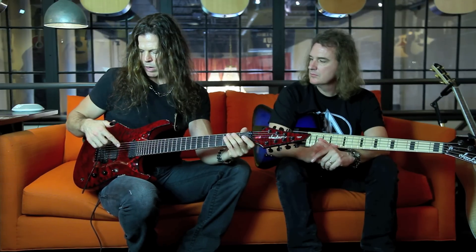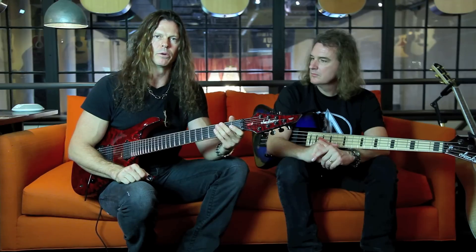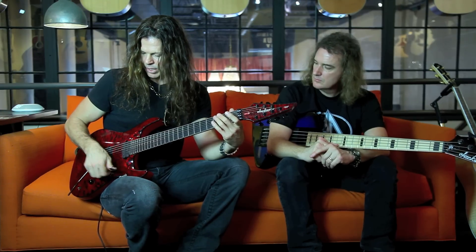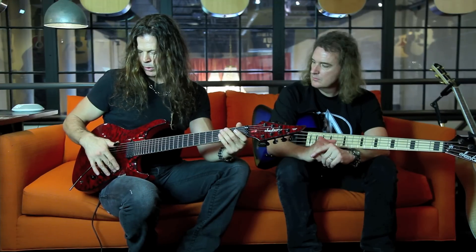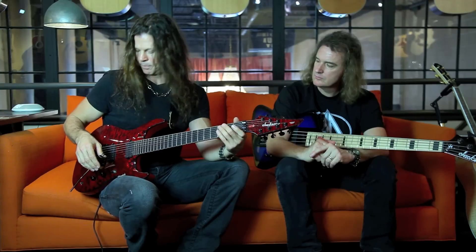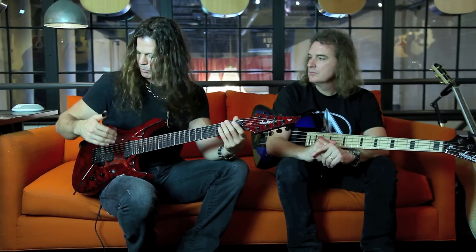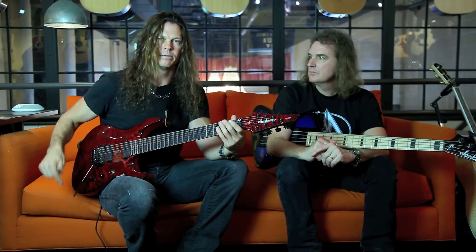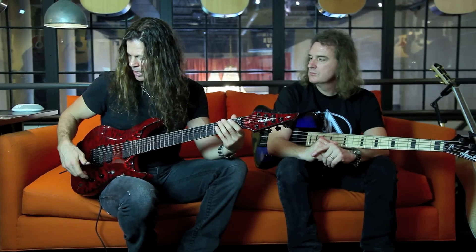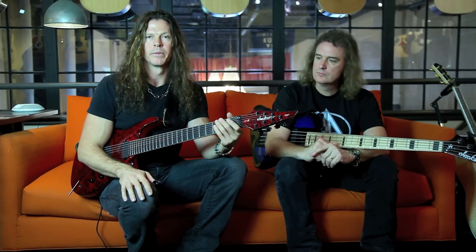Custom pickups in this guitar — custom wound with a bit of a mid-range peak in them so that it brings out the fundamental note a little bit more. I have a push-pull volume knob so you can split them, giving you traditional neck, both, and bridge settings on the switch, and then splitting both at the same time so you can blend them any way you want. The tone is actually out of line until you pull it — because any time you put a potentiometer in line you're losing signal from the pickups and I didn't want that. I don't use a tone knob much, but I put it in there — pull it and it's right where you want it, push it down and it's out of line. Best of both worlds.